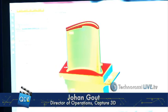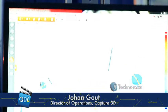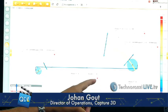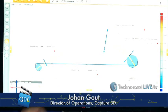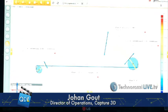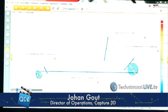And on top here, we have some industry-specific modules. This one is the blade module, where we have the ability to take the key measurements in a pretty automated fashion and extract them from the scan data. The great thing is, once you've created this for one of your profile measurements, you can actually save it and then apply it at different areas on the blade. We also have a similar type of module for the sheet metal industry, for example.